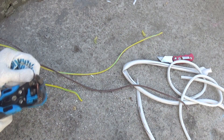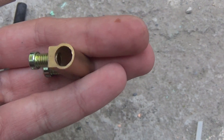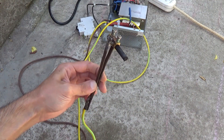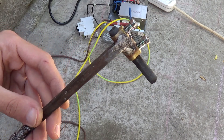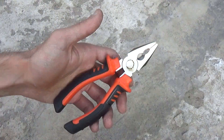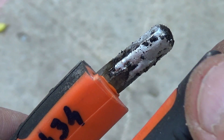Now we need to make a holder for the electrode and the ground connection. For the ground we can just take pliers, attach wires to them, and that's all. I decided to make a convenient holder for the electrode. I found a mounting terminal of the appropriate diameter into which my carbon electrode freely enters. Then I found a copper pipe in old stock and flattened it out. Everything was soldered together to get the holder. It may seem that the soldered places will heat up during operation — yes, it's true — but the solder doesn't melt because the heat capacity of the connections is high and the heat is quickly transferred to the handle. I also isolated the handle with heat-resistant Kapton tape. Then I took the pliers, removed the insulation, and soldered the wire to them — this is iron and can be tinned with the use of soldering acid.